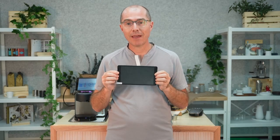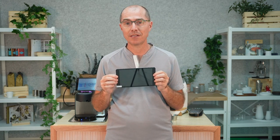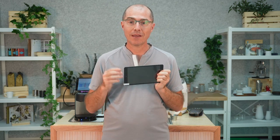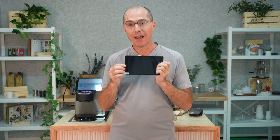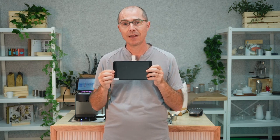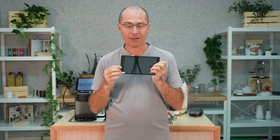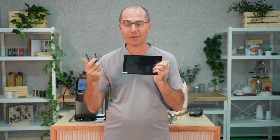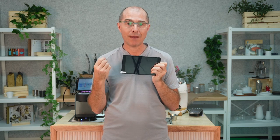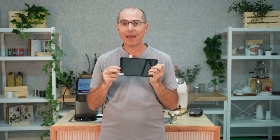This is a tablet made by Pippo — an 8-inch tablet that comes in Android 5.1 and 8 versions. For the first five years of Decent Espresso's life, that's what came with the machine. Because the Decent is always keeping the tablet on full charge and Android doesn't have smart charging, these batteries do die after 3, 4, or 5 years — sometimes as little as 2. When that happens, we've been simply replacing the tablets. It turns out we can take the battery out of the loop and wire them directly into USB to bring them new life. The battery-free kit we make for the Teclast tablets also works for the Pippo tablets, just a little bit differently.